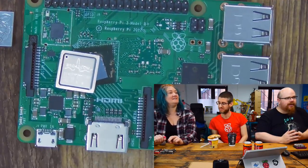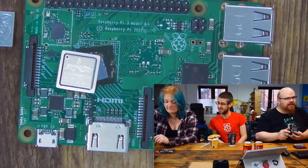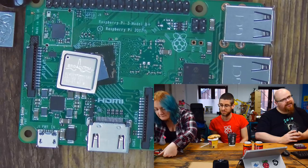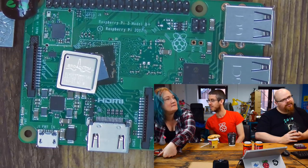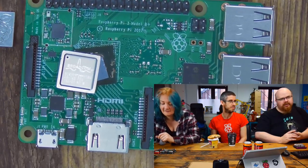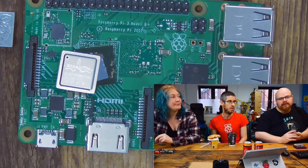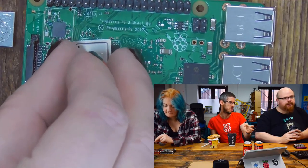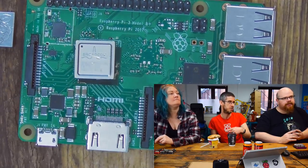I have managed to get the Wi-Fi can off now. Cool. There you go. There's the chip, and you can see a little balun there, top left of the footprint. That looks like a radio balun, which does magic things to make it very frequency discriminating. So that's what the antenna feeds into. The signal from the antenna feeds through that.